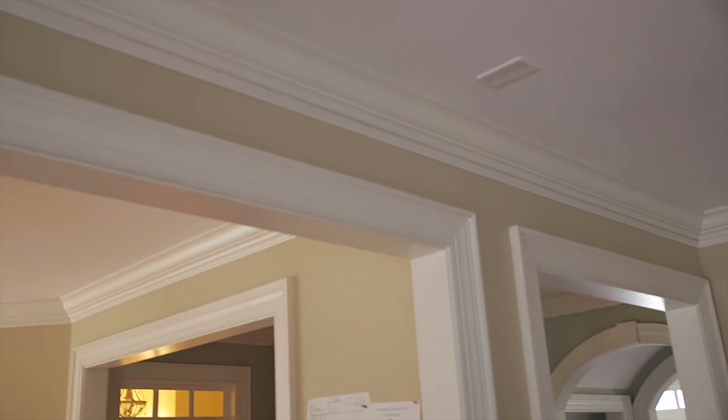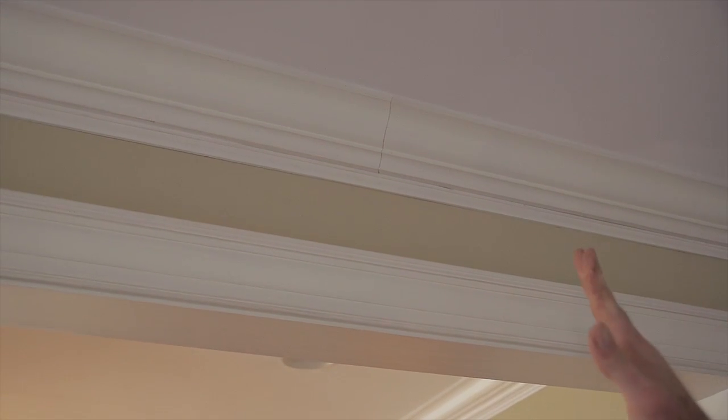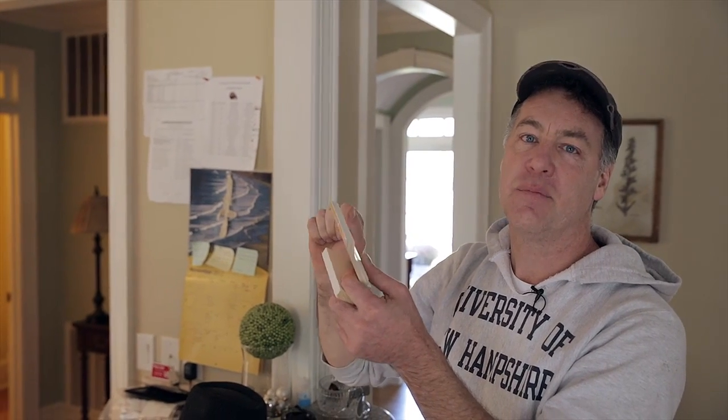The between-corner joints on long walls — when you have a wall that's over 16 feet long — you don't want to butt the two pieces together at a 90-degree angle. You do want to angle it a little, but it doesn't have to be 45 degrees. Something around 20 or 22 degrees works, because the longer the angle, each piece of wood is slightly different and there's a greater tendency for them to be off a bit.